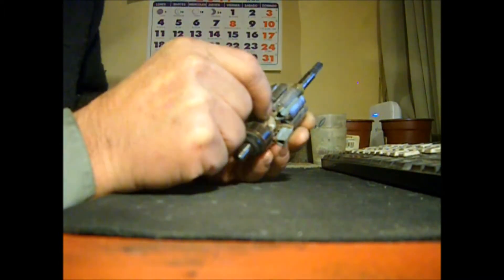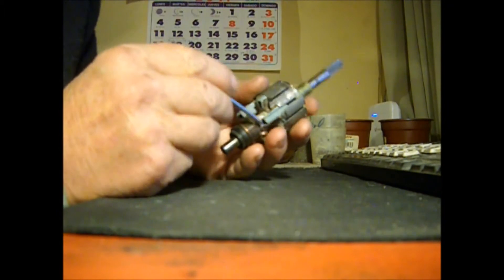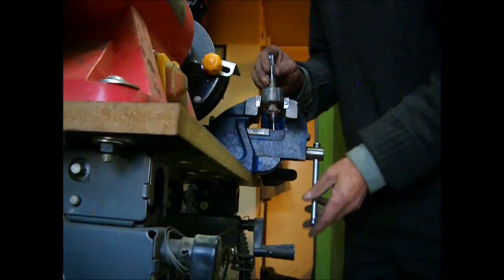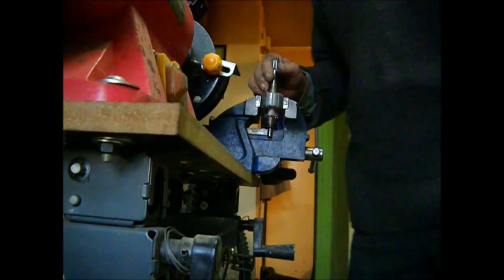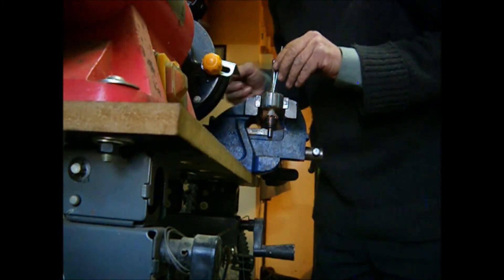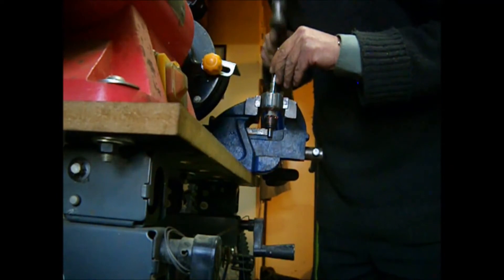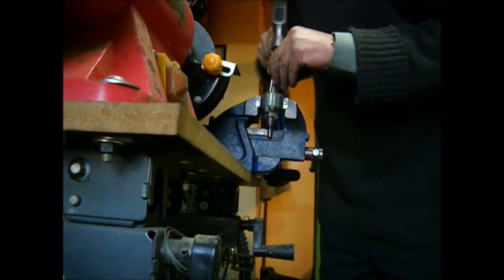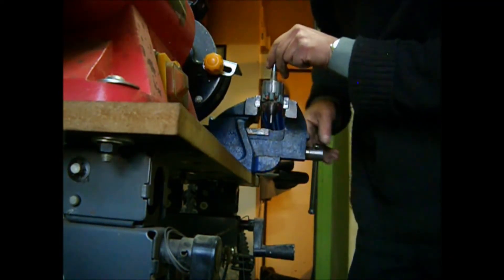It comes out the other side with the plastic jacket that covers the copper. My procedure is to fix it in the vise and with this tool go pushing each section of copper winding out the other side, one by one all around the rotor. Sometimes one just needs a few blows and then you can pull the blocks out by hand. Other times it's a tougher job.